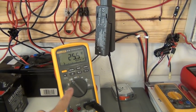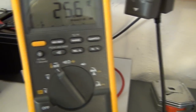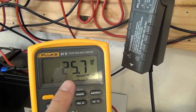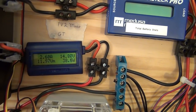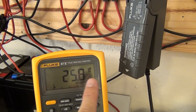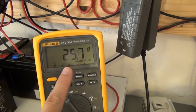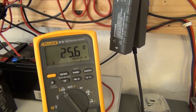Let's see what this looks like on the Fluke without transformation. I've got the Fluke connected up with the current clamp zeroed beforehand. It's set to the millivolt DC setting and showing a reading of 25.7. Remember we're on the 10 mV/amp scale, so we divide by 10 — that's 2.57 amps. Checking the watt meter, it's showing just on 2.6 amps, so certainly not too far off. Without transformation you'll be reading millivolts and have to realize you're actually reading amps, then divide by 10.